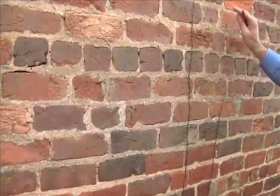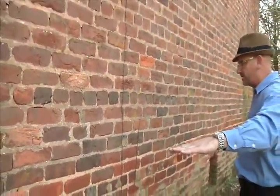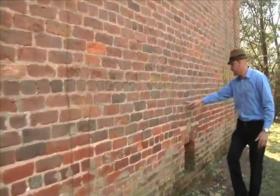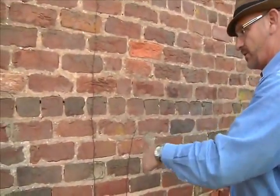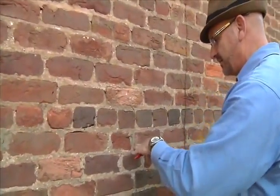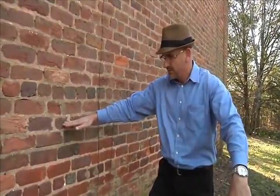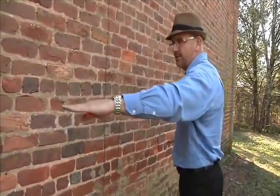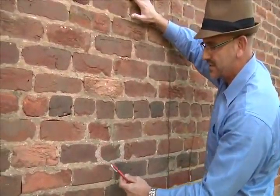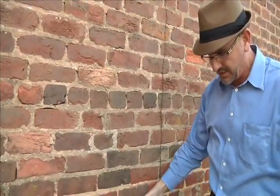So what does that tell you? It tells me he had a piece of a post in here that came out, and a leg, and he had a board up here so he could stand to lay the brick. So the post would go in there and hold up a board. He'd lay it — when he's laying the brick wall, he had just a round pole, like a fence post. When he laid up to here, he'd lay this post into the building about that far, then come out with that post and have another post here to hold it horizontal, then he would have planks so he'd be standing up here laying his brick. He could have put a post here and here, but then his scaffolding wouldn't have been stable. It was just a simple way to scaffold a building as you laid the brick.